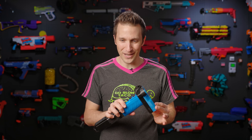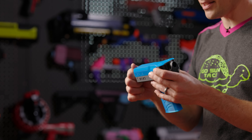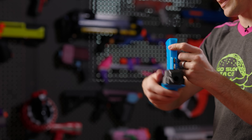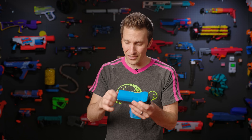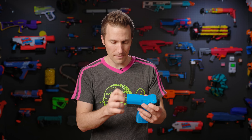The blaster is quite easy to print. Most of the items print either flat on the bed. This top cover prints like this, the base prints like this, and the grip itself prints upside down. The flywheel cage is similar — flat on the bed — so the prints themselves were actually pretty easy to do, and I think this is actually a pretty good candidate for a first-time build.